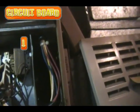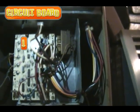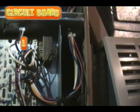We're going to take a meter and we're going to check for power on the board. If you follow these wires down here, you have red, black, and white. White is common, and you can see they just go right back to the blower — there's only those three. Red is low speed, black is high speed, and white is your common.